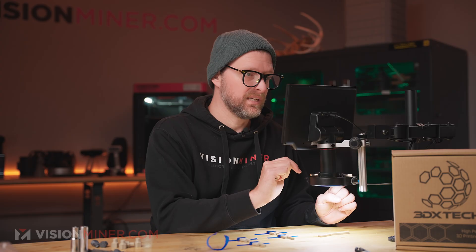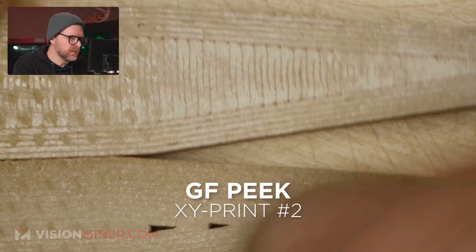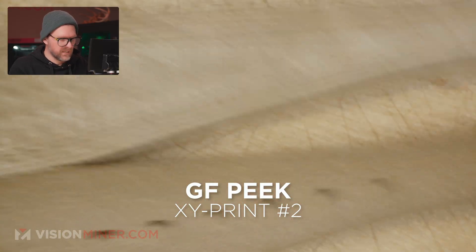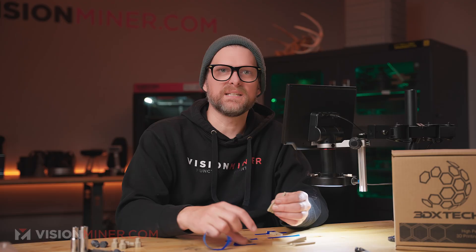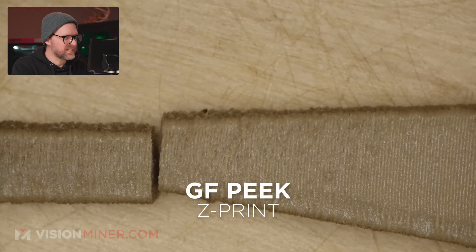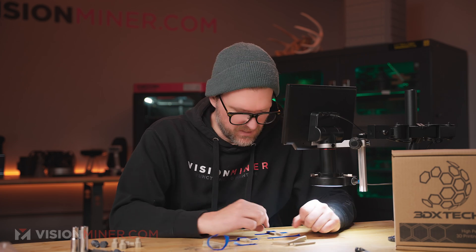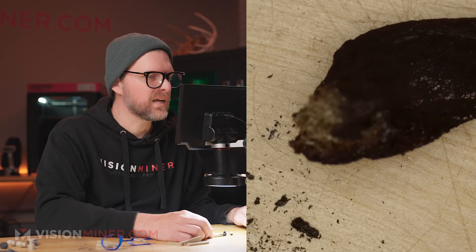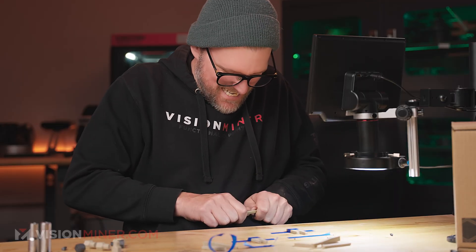A second sample printed with a different infill pattern spacing was actually a bit weaker — you can see the gaps. Overall, GF-PEEK is our strongest material by far in XY; the Z axis was a little weak which may relate to this specific material. Looking at the part exposed to the blowtorch for so long, there's still plenty of intact PEEK in the center, proving it doesn't necessarily melt. Breaking it open — wow, there are the glass fibers. That's cool.